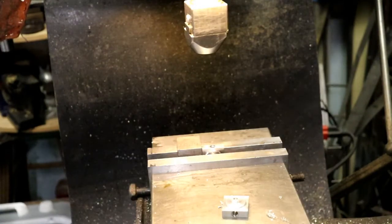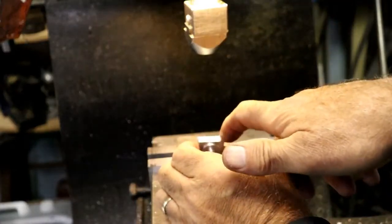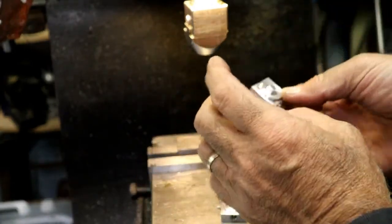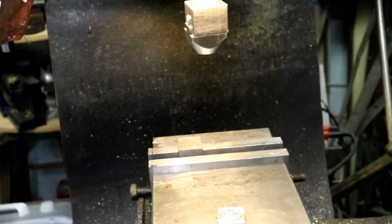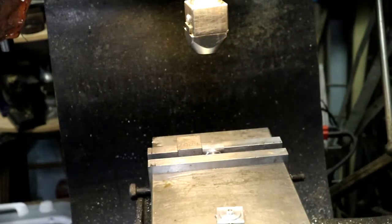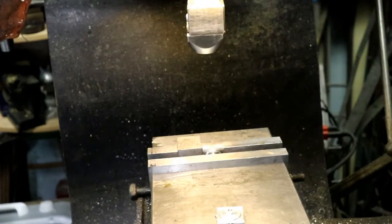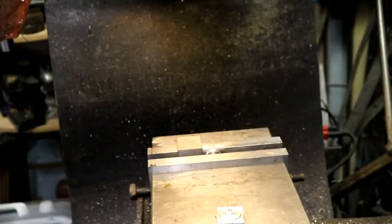Alright, the next thing to do is put the 2 screw holes in on the side. So 2-56 threads go. That's what goes in the bracket that holds it in place. So we can use the exact same setup. Exact same setup, and we don't crank it on Y, we leave it alone. Take the boring head out. Put that back in the rack.